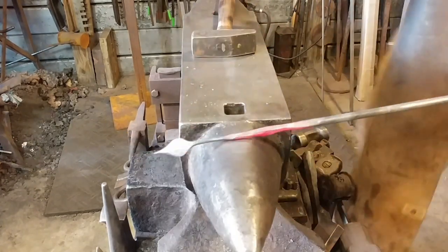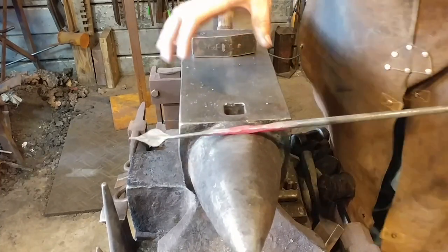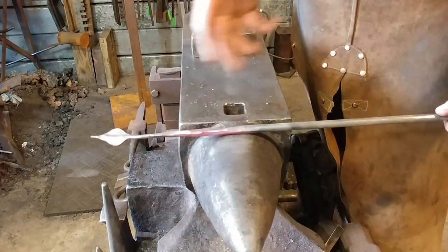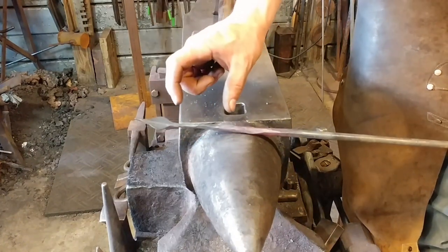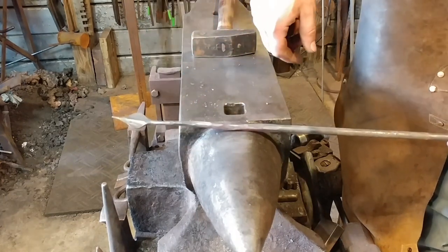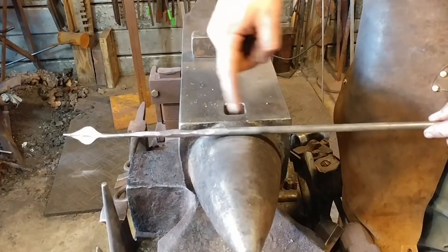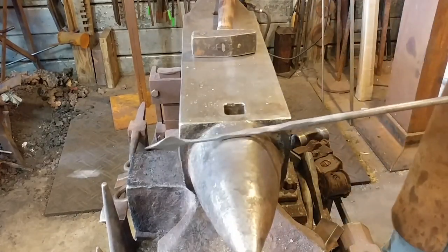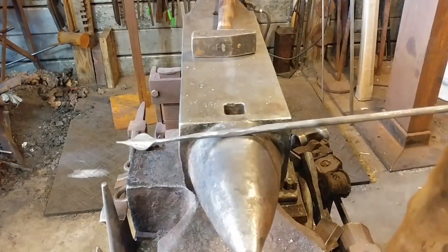The next step in this process, we are going to make a bend. The trick to making this bend I do mostly by eye. The reason I work on such a long bar of stock is it helps — if you don't bend enough you can always bend a little more. I figure about three inches is enough material to bend over the edge of the anvil to come back and make our bottle opener portion. We may have to texture a little more on the stem, but we'll cross that road when we get there.